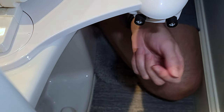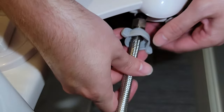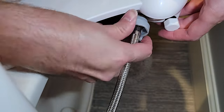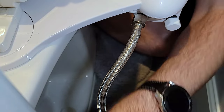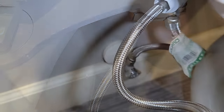Go ahead and disconnect the water line from the base of your toilet so you can install the splitter. If you choose not to hook up the hot water line, go ahead and install the cap on the hot water line of the bidet itself. Then connect the cold water line to the bidet using the plastic attachments to screw it on nice and tight, and attach the other end to the splitter over by your toilet.